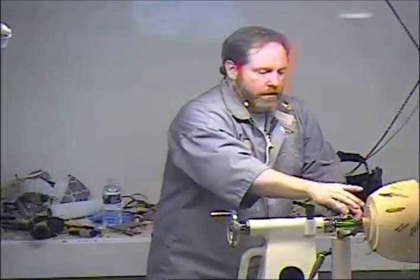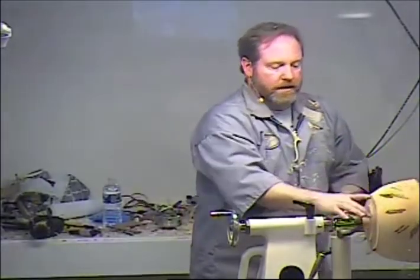And then when I flip it around when I'm all done to make the foot, I'm going to make it even smaller again. So you have to be thinking way ahead that this green wet wood, the tenon needs to be the biggest that you can make it so that you've got material all the way at the end, a year from now. But yes, I see what you're saying. With wet wood, your chuck jaws are going to squeeze in there a lot easier than a piece of dry wood. Okay?